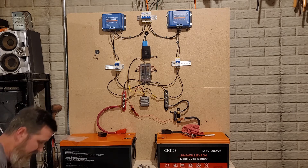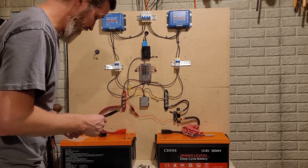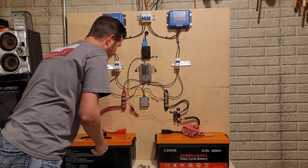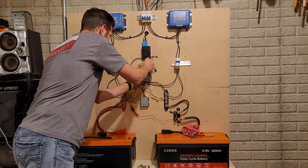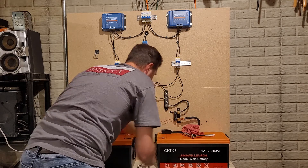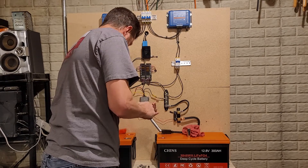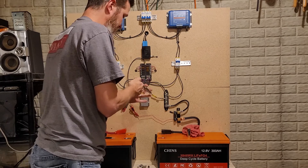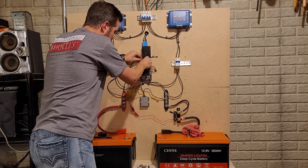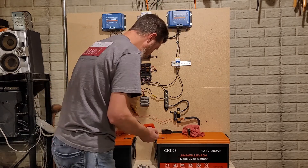There is my connection cable between my two batteries. I wonder if I should disconnect my step-down output block and measure the voltage first so I don't blow all this stuff up — yeah, let's go ahead and do that. Let's disconnect these two output wires, because I just don't want to find out I wired something wrong and have my Raspberry Pi and all my lights blow up. Connecting the two batteries in series like this will make the system 24 volts.